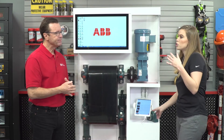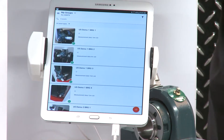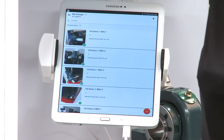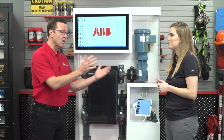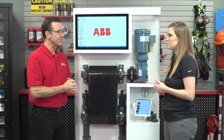Through Bluetooth, the sensor provides measurements of temperature and vibration. These two parameters provide key indicators of the current condition of the bearing. The readings are then sent to an app on the phone of the maintenance person responsible for the bearing. It's compatible with iOS and Android-based devices.